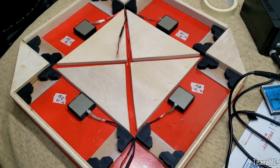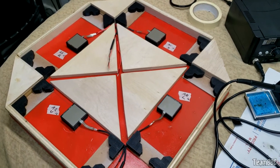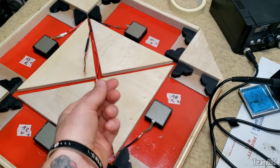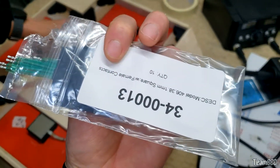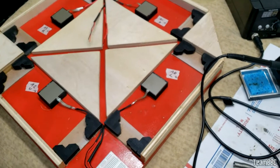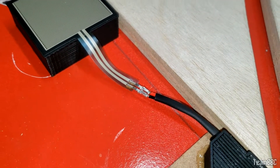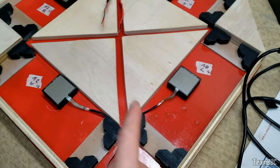We're doing the wiring now. We're planning to cut this pad diagonally so it's more portable for travel — as it stands it won't fit in carry-on luggage. The cables are chopped short so we can add quick connectors. We ordered 10 FSR sensors — you never know when you need spares. I poked a wire into each female connector then soldered it so it won't come out. To replace a sensor you just unsolder and re-solder. All wires run to the corner where our little computer lives.